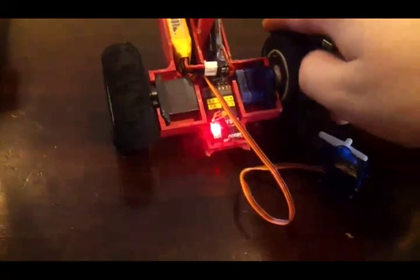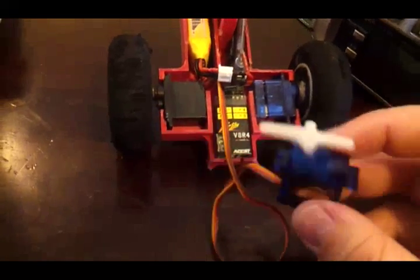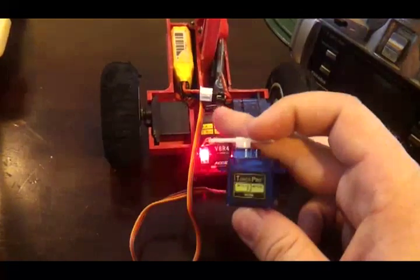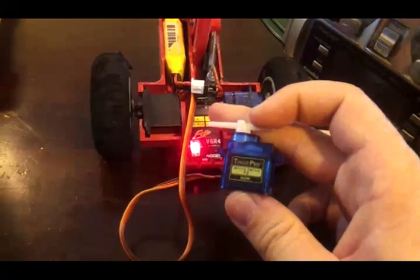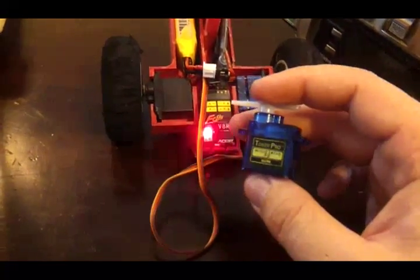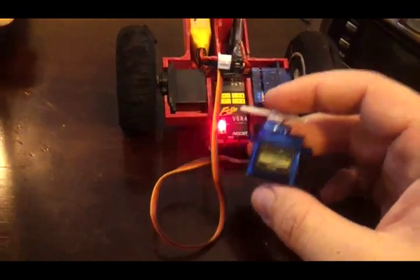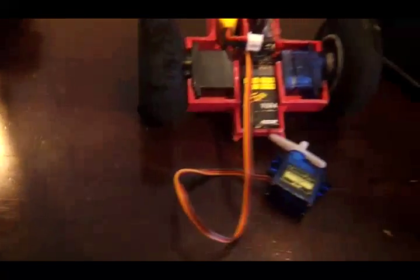But what we're doing — we want the output of the servo to go continuously to drive a wheel. The reason why we use the servo is a little servo like this weighs 9 grams and they only cost a couple of dollars each. They all come out of factories in China and they pop them out a million at a time — a couple of dollars each. And you get a nice little motor, a gearbox and a PCB all together. But to get them to run continuously, we need to modify them. And so that's what this video is about.